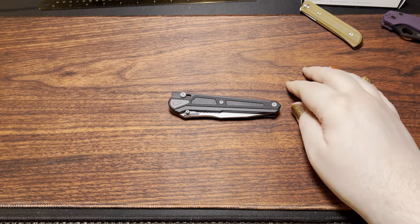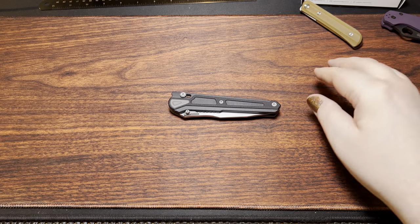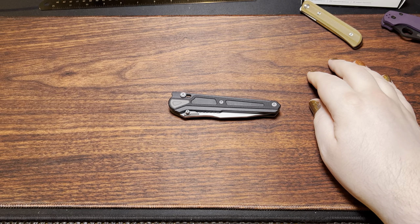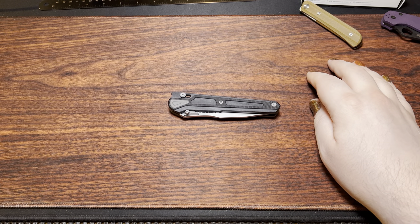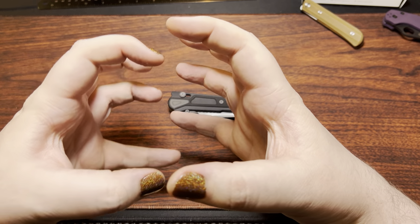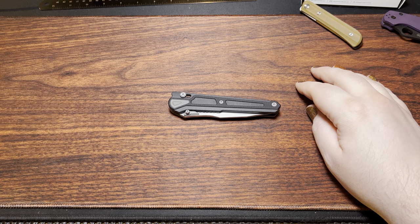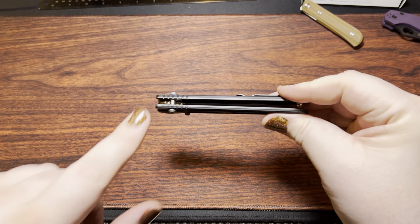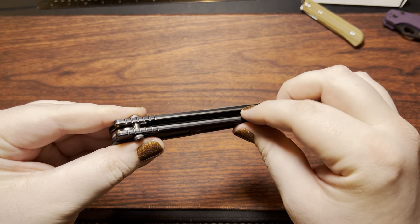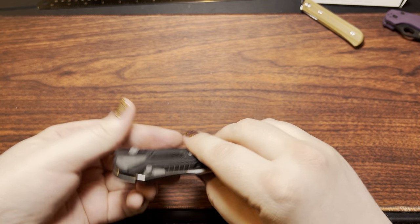You can actually get stainless steel bearing material — 154CM was specifically designed for ball bearings, but it's kind of difficult to machine, so they don't generally use it for small bearings. This knife has steel bearings, and dual row at that, which is neat. The blade is tucked up super nice — there's basically no way to get to any of it. The thumb stud works super nice for flicking it open, and the Axis tabs are quite proud, which helps with leverage.